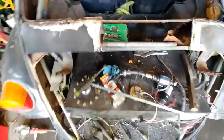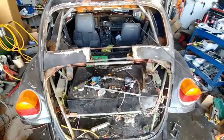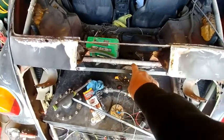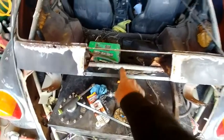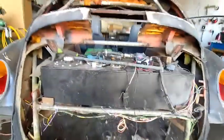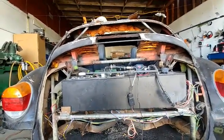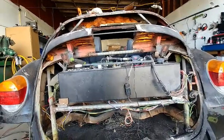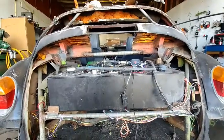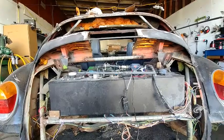And then I can prime my little sheet metal pieces and stuff on both sides, so it's up in here. It's not going to rust on top, even though the stuff right next to it's kind of rusty. At least I'll put a good piece of metal in there and weld it. I'm going to try to bring it all the way down to that round bar, all the way up. It would be best if I could do that in one piece and weld it in.